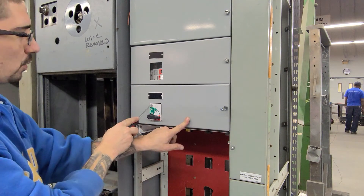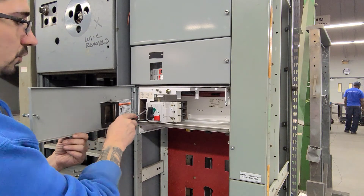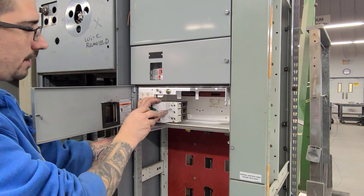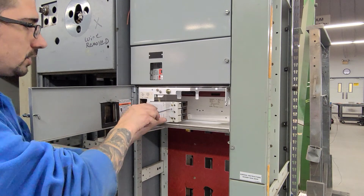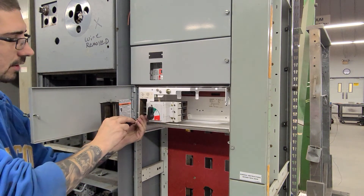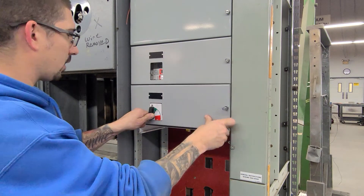If you're not happy with the way this is sitting — it's sitting a little bit to the left — you can loosen your four screws, take the cover off, and shift the breaker just a little bit to the right, then reattach your handle. You might be able to loosen these screws here for a little play, but not much. Just hold the breaker and handle all the way to the right while tightening to get that cutout to line up a little better with the face of the operator. Not a lot better, but a little bit better.